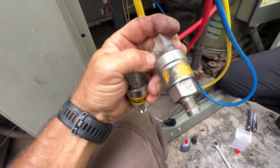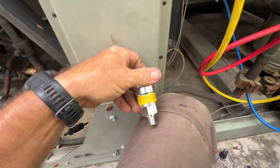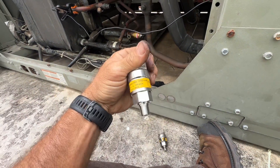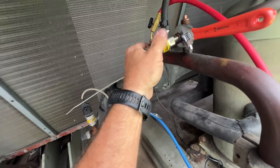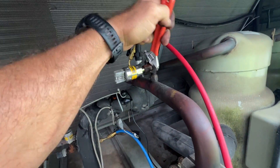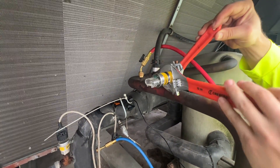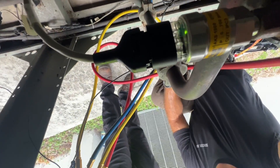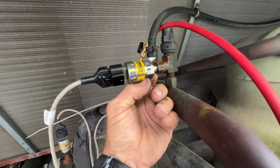All right, let's see what we've got here — part number 1008. All the other numbers have pretty much evaporated, so we're going to roll with this. It can do 700 PSI. Applying a little Nylog there — there we go. Tighten the fitting. It's not bound yet. Alright, no leaks apparent.